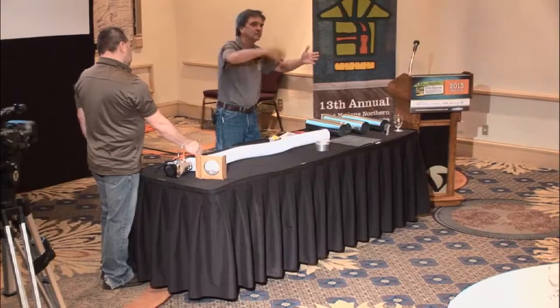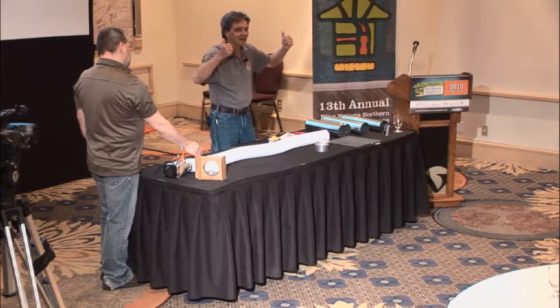I actually have a film showing a HRV installed in a house that I bought. I love this. That had the HRV coming out the soffit here, and 6 inches away was the intake. We put smoke in the system, and we actually have it showing it going out and back into the house. Okay?